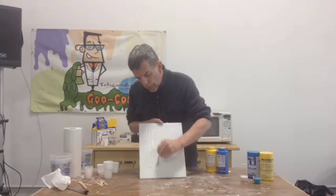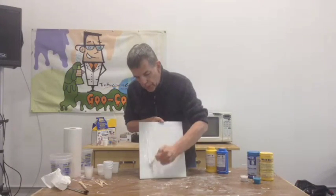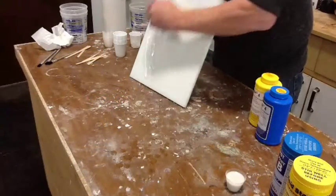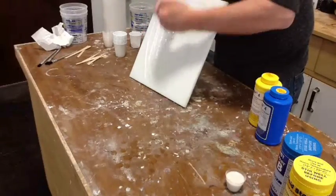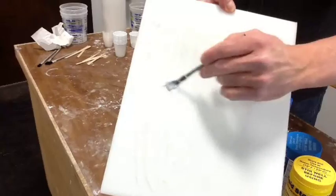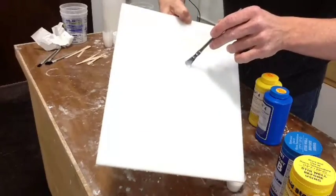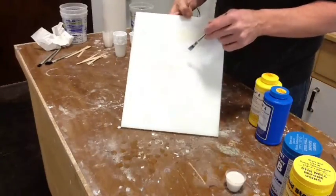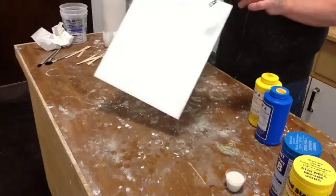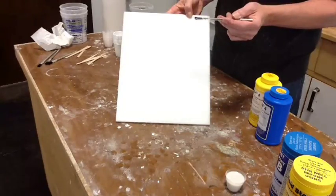This is a little thicker than it ought to be for a vertical surface, but I do believe I am getting the point across. If you did that, you could almost turn this stuff into a really fast laminating resin — you could throw some fiberglass in this and it would totally work. And it doesn't even look all that chunky. There you go. That's how that works in a plastic — you see how it turns your basic pourable plastic into something you can brush. Pretty cool.